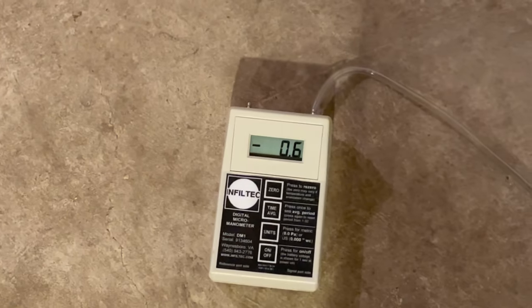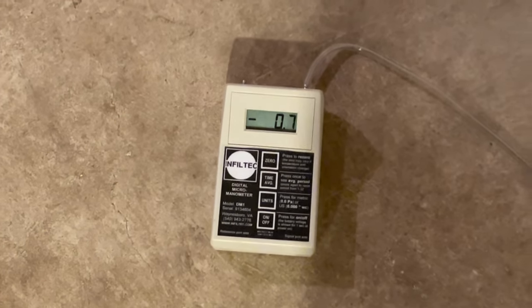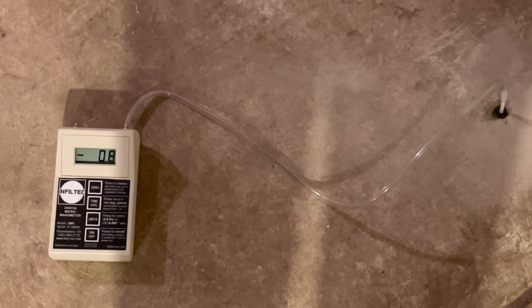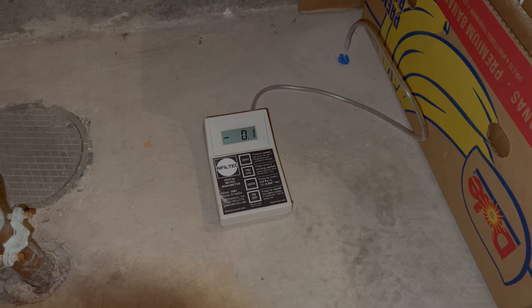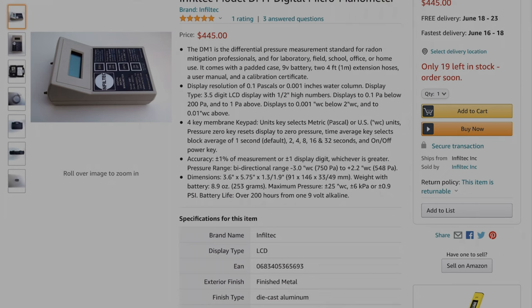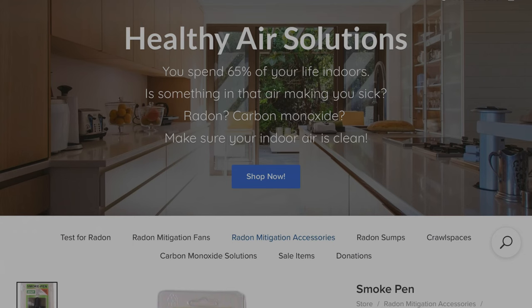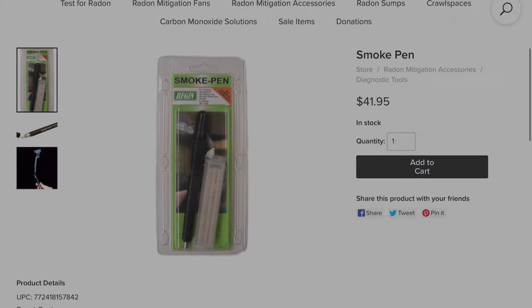So we'll be using a digital micromanometer, which will enable us to get real-time readings of the suction that's happening underneath the slab. And what we'll be looking for is a reading of -2 pascals or more, and this will show that we're getting that air movement that we're looking for. And you don't need to go out and purchase an expensive digital micromanometer. You can accomplish the same task using a smoke pen, and you can find a link to where to purchase one in the description below.